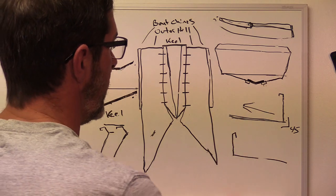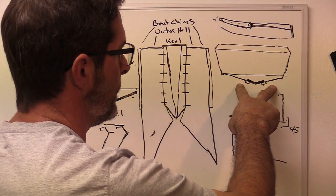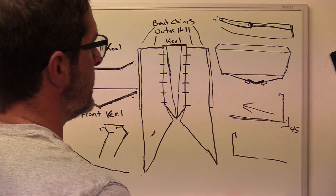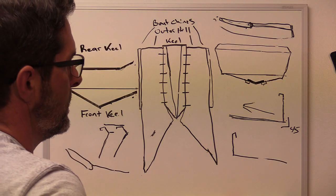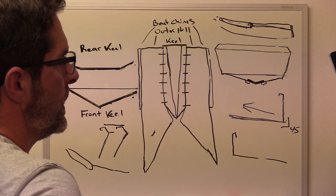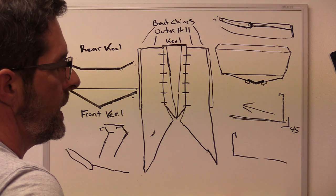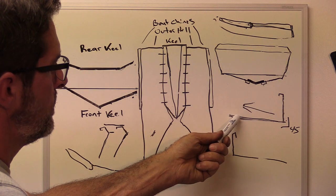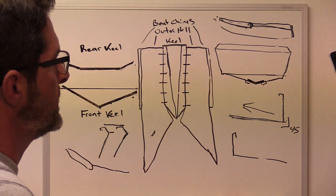get close to the right height, and these angles are already set by this flat bar, by these being tacked to the keel. It's just not a big issue unless you're bent wrong. If you're bent wrong, the thing is you're going to block it up if you don't know about that keel. You're going to block it up even. You're going to create this rise on the left side of the boat like I did.